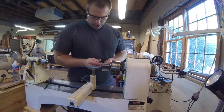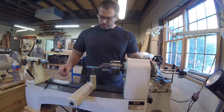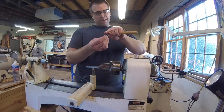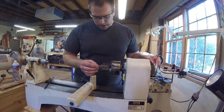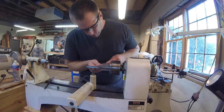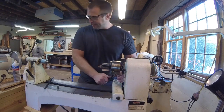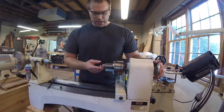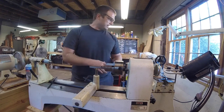Now I'm going to come back behind where I'm going to part it off. You can decide how far you want it to stick out — whether you want it rounded up or set flat flush, it's really up to you. I'm going to leave mine coming out just a little bit and bevel the edge on this one, kind of rounded up. That's the basics of it. We're just going to give it a little sanding and a little finish. Once your finish is where you want it and polished up, we need to get this finial insert off of the lathe, so I start by parting it down quite a bit more.